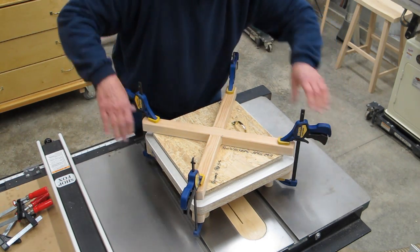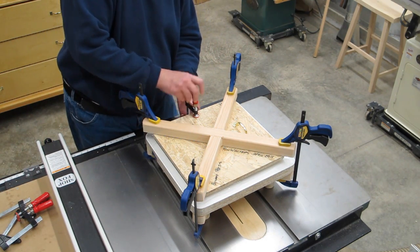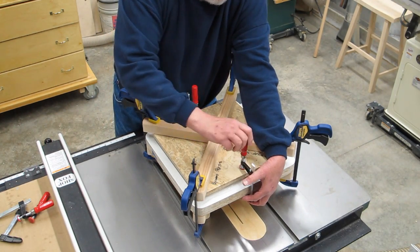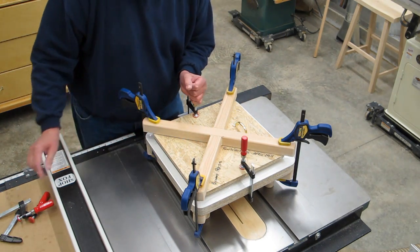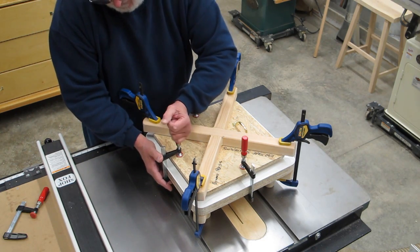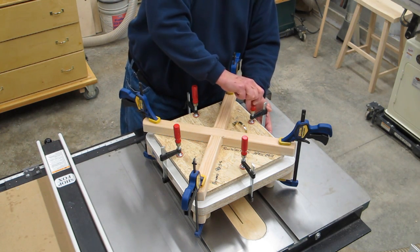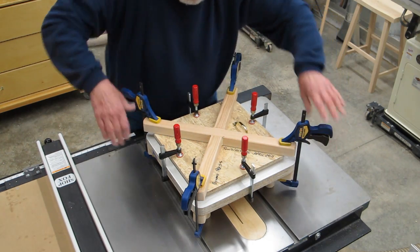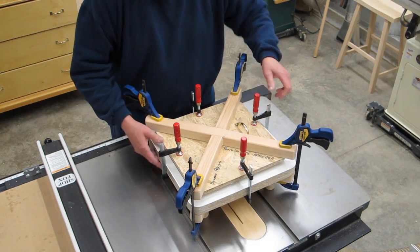These clamps are pretty much self-limiting in how much pressure they put out. We can put these small bar clamps in between, but we need to be careful how tight we tighten these — they will put out more pressure than the pinch clamps. I'm showing you this now so I don't have to explain later when I'm putting the glue on. Then we just go around and tighten opposite clamps, making sure the pressure is pretty even and not too tight.